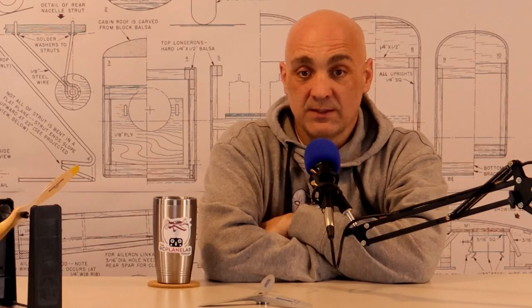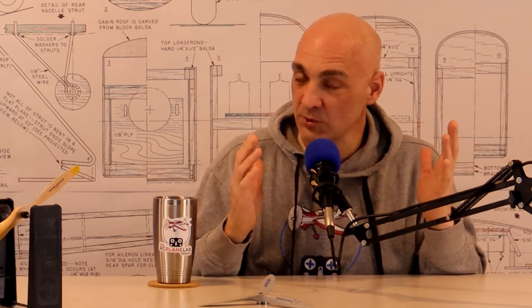Once you've got the propeller clamped onto your spindle, it's a simple matter of setting the spindle. I like to mount mine so that the uprights are parallel with each other at the same height, if I can get away with it. I just set the spindle right on top of the rollers, and that's pretty much all there is to it. From here on out, it's where the patience comes in. Once it's on the rollers, I like to set the propeller so that it's horizontal. In the case of a two blade, both blades are horizontal. Then I just simply let it go, and the heavy blade will usually fall.